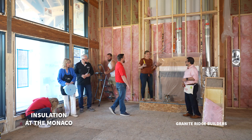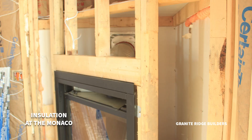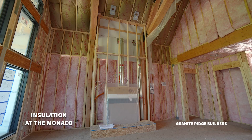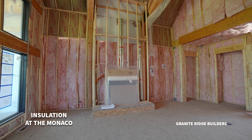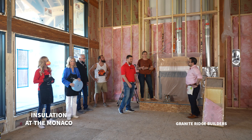Fireplace — there are a lot of important components that go into the fireplace, and we need to make sure there's enough of a cavity here for the piping and insulated pipes. Just making sure all this is buttoned up before we drywall. A lot of people think insulation is only on the outside, but we need to make sure because we've got a hot box in there that it's insulated well from any combustible materials. We've got a double-wall insulated pipe to make sure that things stay at a nice temperature so there are no fires potentially down the road.